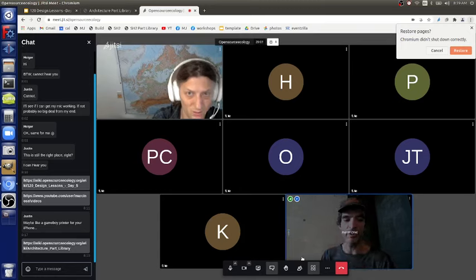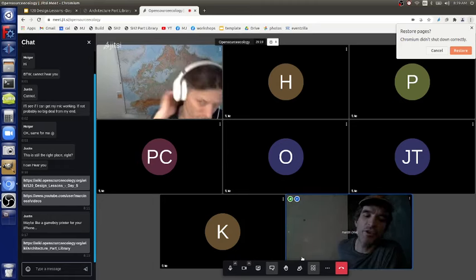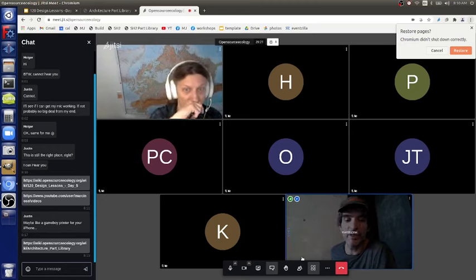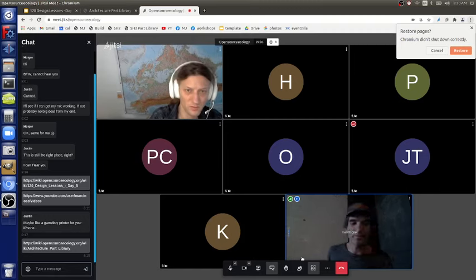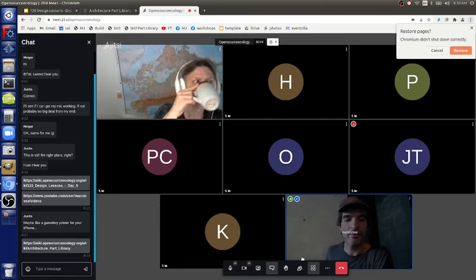So you can work off a common coordinate system like this file of a foundation, so that every person puts their module where they work in their 3D CAD document. They can actually work in a positionally correct location, so that when you merge all the files together, they actually line up next to each other. But you have to have a reference, like for example, a foundation drawing, or just really good knowledge of coordinates. Like you can say, okay, if I'm working at 0, 0, 0, I know that 32 feet over, if in your doc you look at the XYZ coordinate, which is in the information on your FreeCAD file, and you see, oh yeah, that's now 32 on the X, well, you know you're all the way at the right corner of the house if you define the coordinate system. Like, we all agree that the house is 0, 0, 0 at the bottom left corner. So you can coordinate positionality that way.